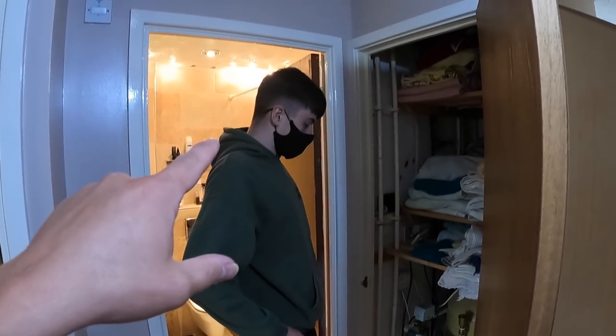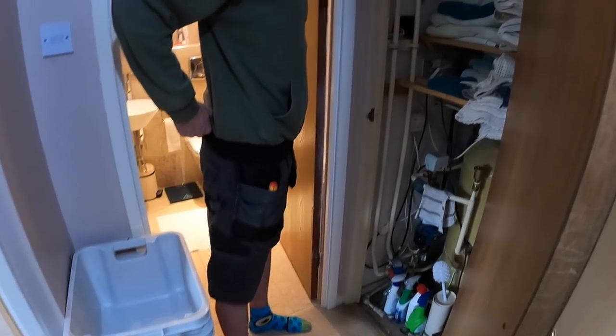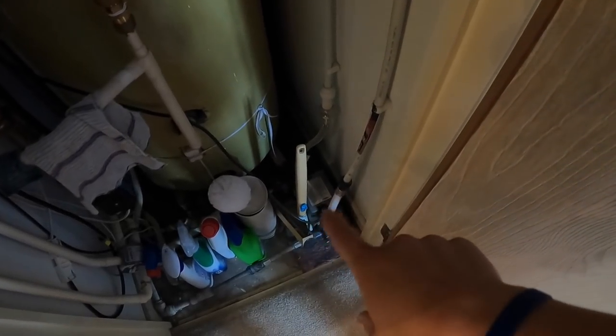James has got a bad foot because he's been playing football and got cropped — he was the tallest guy on the pitch so he got picked on. So, we've got six mil leaving the board feeding a shower pump just there. There's no load on this shower — there's no need for that to be six mil; it could have just been 2.5. So to me James, that comes down in six mil, but this is protected by a 32, and that doesn't look like six mil — looks like 2.5.